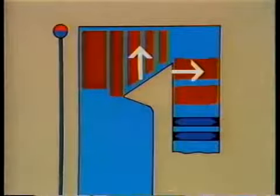Erosion in the superheaters and reheaters can also be caused by a steam jet from a leaking tube. A steam jet from a leaking tube can erode the metal of adjacent tubes until they also leak. When inspecting superheaters and reheaters, be sure to look for evidence of erosion in areas around known leaks. Also, eroded areas may indicate leaks that were not previously detected.